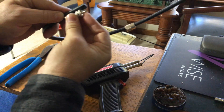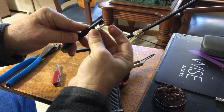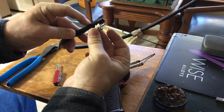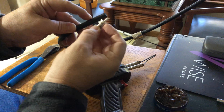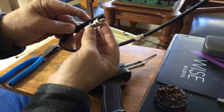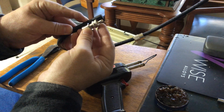This is the way I learned to do it at Motorola. I'm putting the PL-259 next to the coax. What I want to do is trim the rubber — the plastic PVC — back to right where the threads are. I'll put a little indention there with my thumb and cut around that.